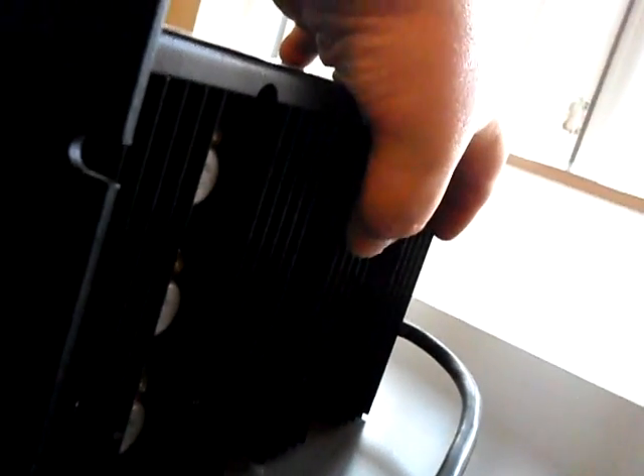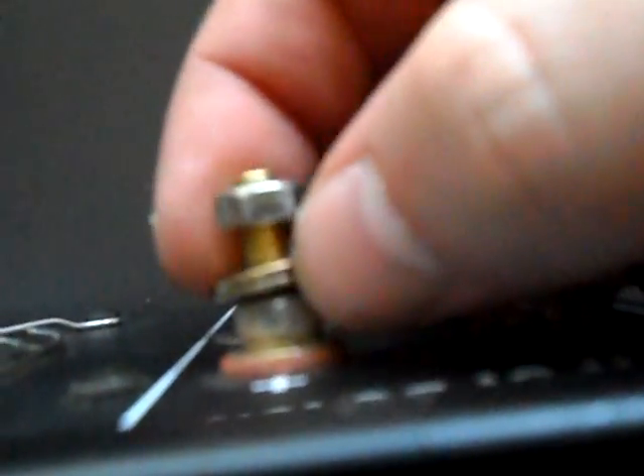It is rack mountable, but you have to be serious about it — it's no joke. If you're running it hard, there are fins on the side and you can add a fan here and another fan here. There is a stock fan on one side and fins on the other side for all the transistors. You should add a 120mm fan to each of those sets. There's also one in the back, and there are lugs in the back — this one's negative, this one's positive.